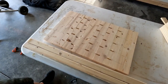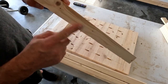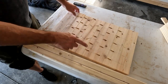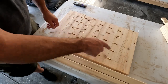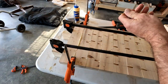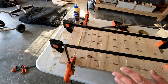My pocket holes are drilled. If you cut these down to three inches, when you do your pocket holes you may come out the edge of the board — I don't want that on the end of my table. So I make sure the end boards have a nice smooth surface with no pocket holes exposed. That's why I had to do a double pocket — one goes this way, one goes that way. I'll run my screws in starting from the center and then work my way out to the outside edges, repeating that down throughout the board.